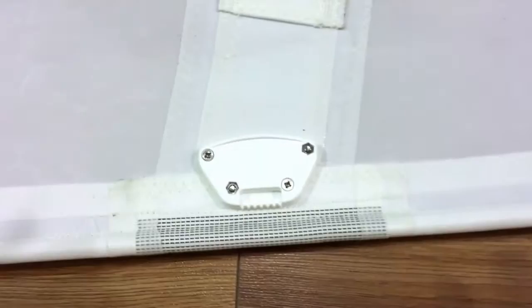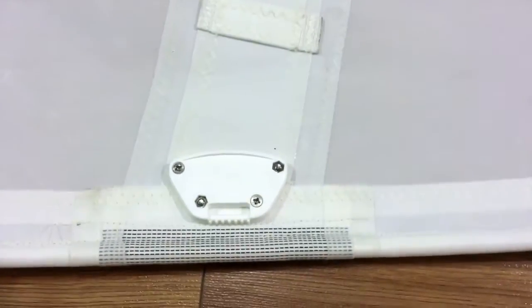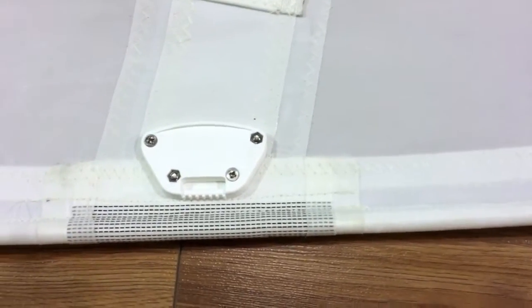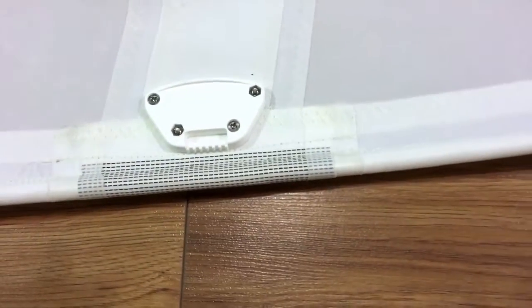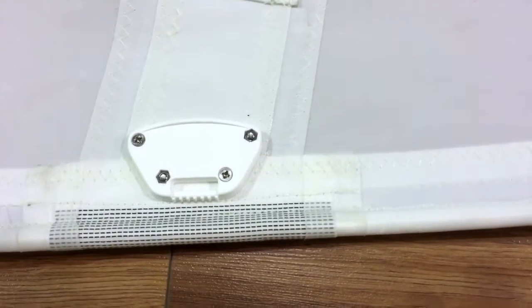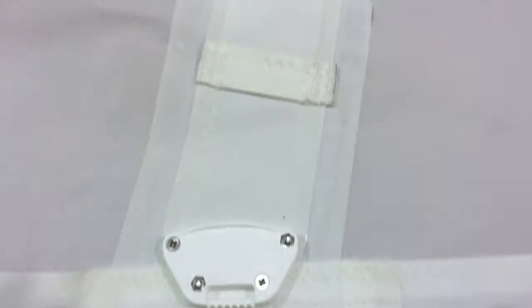So let's just take a quick little look here at this batten receptacle. So this is a full batten, and it's going to slide into this receptacle. And notice the reinforcements that we've done here. Now this gentleman has the luff that goes up as bolt rope, and it slides up his mast. And so we've had to reinforce at these receptacles to make sure that there isn't any damage done when you put some tension on that thing. So there you go. That's how that works.